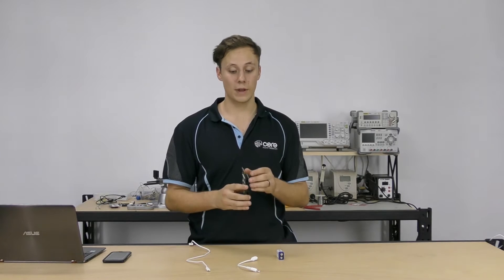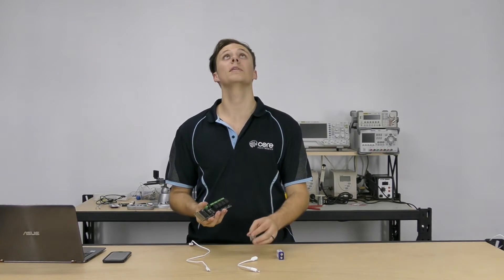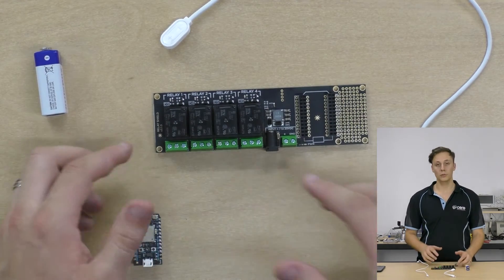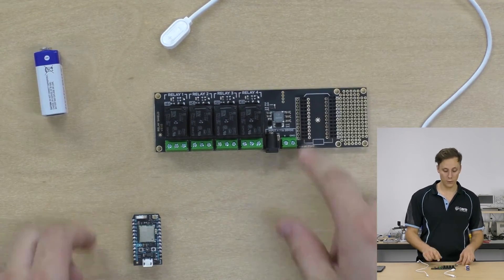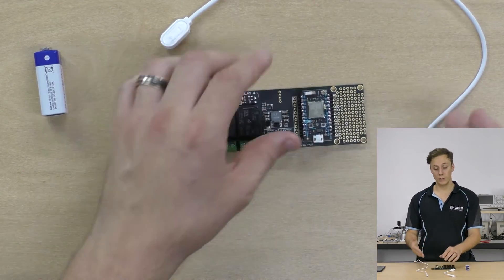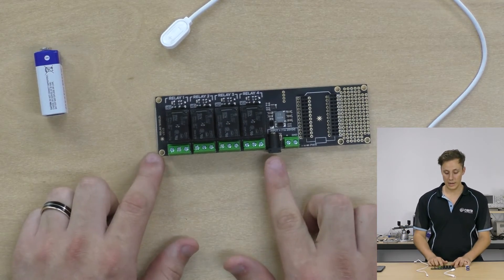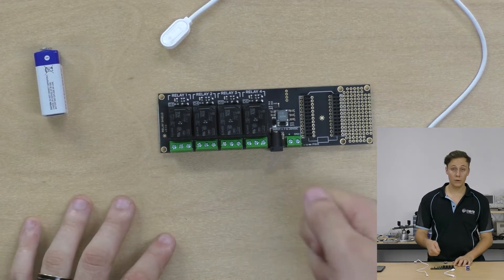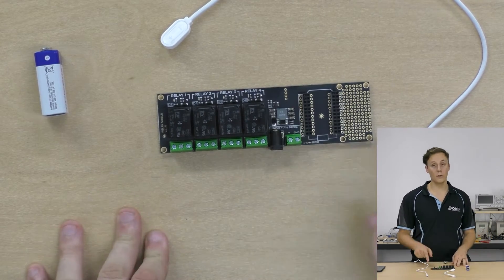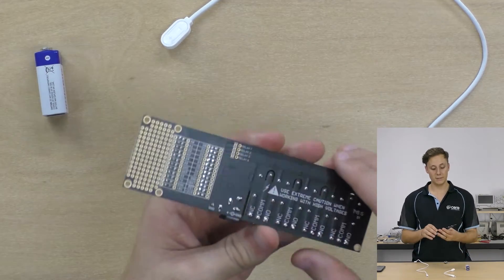This is awesome - I cannot speak highly enough of the engineering and design that went into this piece of equipment. The Particle Relay Shield is a four channel relay board and it includes headers for the Photon, and when you put it in you've also got extra breakout headers so you can attach more things to the pins that aren't being used. It's got a prototyping area and an input to power your Photon - you can power it via USB or connect a DC supply from 7 to 20 volts and it regulates that down to 5 volts, feeds it to the Photon and powers all of the relay circuitry. It's a very well thought out piece of gear.